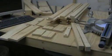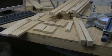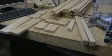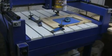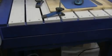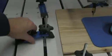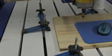On the workbench here you can see a lot of parts that have collected up over the last week. A good portion of these are new designs I've come up with that I can show you in a little more detail about and why I did this. Let's go over to the machine. First off, the white surface here on the table is one-by-fours spaced apart so that you can put a clamp up through the table. This is all well and good, but it has its drawback simply because I have to come up through the entire table to put a clamp in, and then I can only move the clamp about a foot. I can't go down the entire length — I have to take it apart and then bring it up through the table again, which gets to be a real hassle.